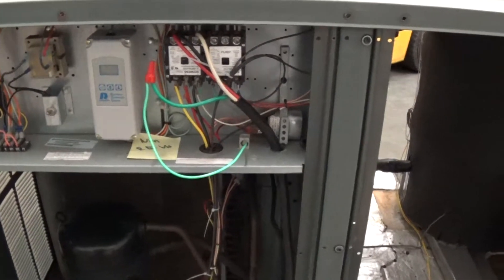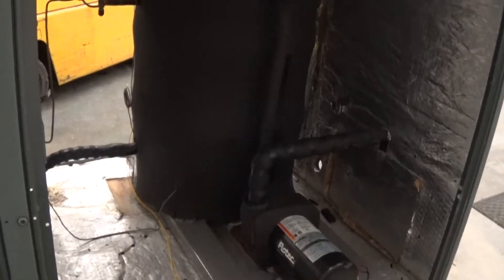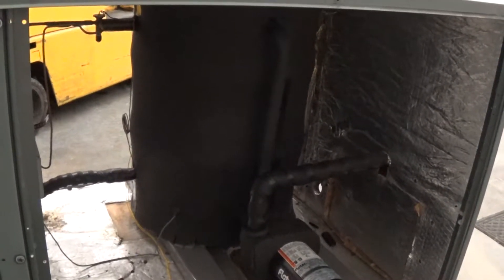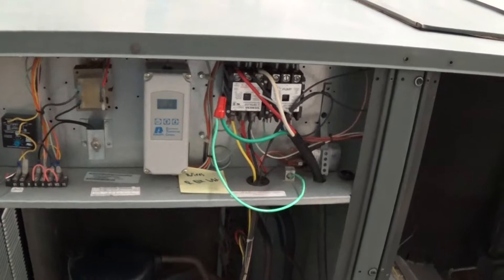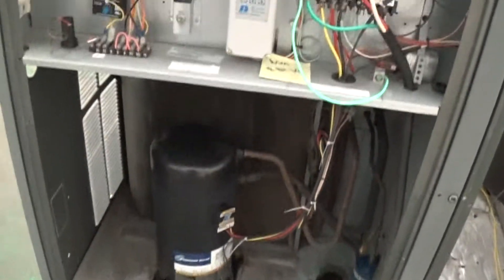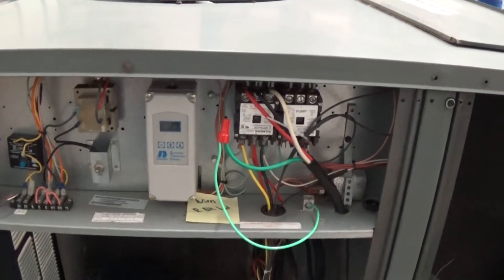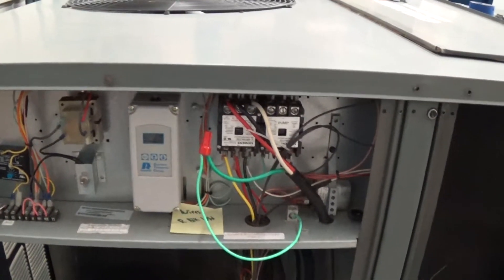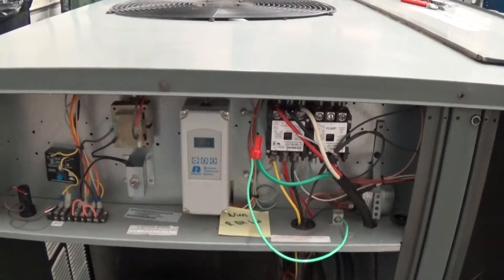Put power to this and have your glycol fluid — or if you're going to do a dry test, straight water — as long as you have fluid in there before you bump the main compressor. The Copeland scroll compressors on these ChillKings are fairly quiet even if you have the phase rotation wrong. If you're going to try to do it without a licensed HVAC tech and without gauges, you can turn the unit on until the compressor comes on.